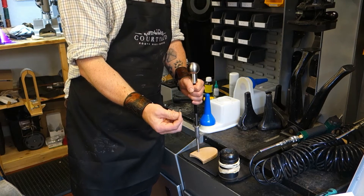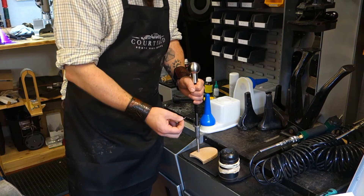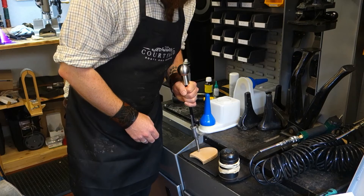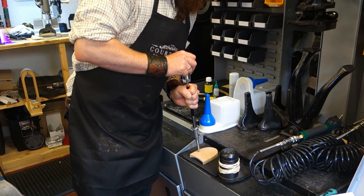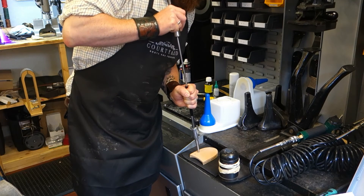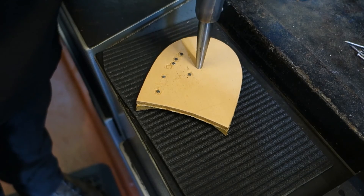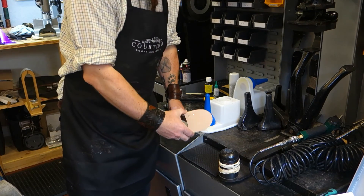I'm just using a 20mm ring shanked nail, or heel nail, for this purpose simply because I haven't got a really thick heel block here. So the idea is: where you want the nail to go in, put it in the magazine, just make sure it's come out — sometimes it's a little tight. I can feel it in there now. And then just nail it in. Simple as that.